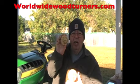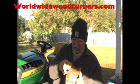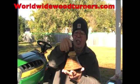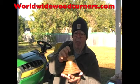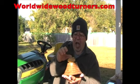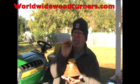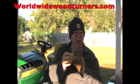I have a depression. I'm only holding on that outside surface. Can you get an idea what that is? That's where the glue is. And this goes right into my tailstock to line up. Then when I get it glued up and it's between centers, I would reach through the dovetail by just a little bit, just to make sure it's really oriented to the screw that's being spun on. Do you follow that?